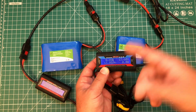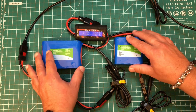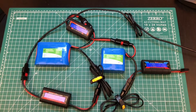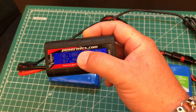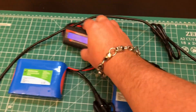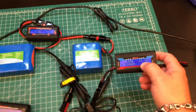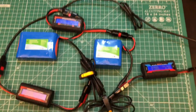Once connected, we're already pulling about three-quarters of an amp from battery A to battery B. Now plugging in the six-amp charger — we're putting in 4.6 amps into battery A, and battery B is taking 2.83 amps of current from that. Battery B's voltage has gone up from 13.17 to 13.6 volts. After about an hour, there's almost no current flowing, the charger light is green, and both batteries read about 14.3–14.4 volts. It works!